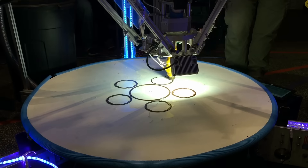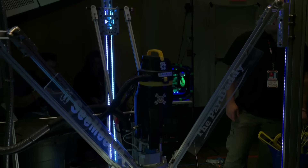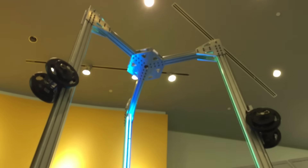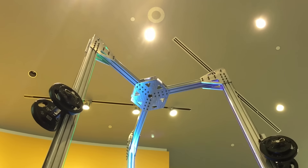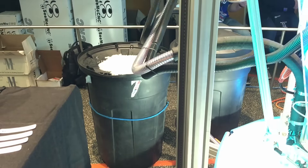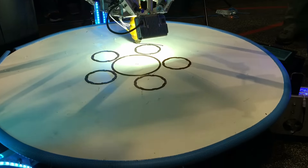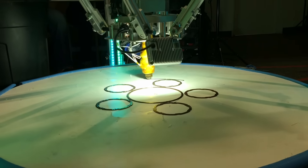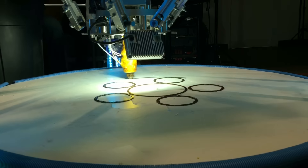The even bigger one is called the Part Daddy. We've brought it around to quite a few maker faires — Bay Area this year, Detroit three years now, and New York, this is the third year we've brought it out. That's a four-foot diameter by nine-and-a-half-foot tall print area. We skip filament altogether and have our own pellet extruder that Steve designed, so we can use the raw material they normally make filament out of. That makes it much more affordable when you're printing a 90-pound part — there's an angel over there that weighs 120 pounds. We've all bought filament; that would get expensive quick.